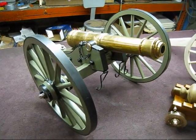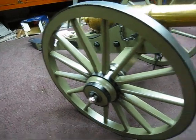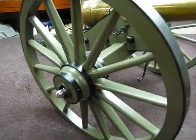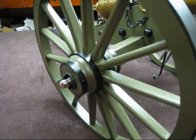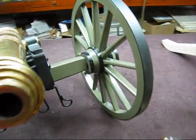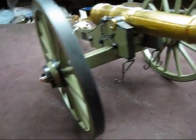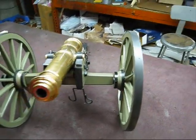One thing I forgot to mention on this completed cannon carriage was the paint job. There are three coats of Interlux 1026 wood sealer on everything and then one finished coat of Rustoleum in olive green. I actually had to do these spokes with the sealer using an artist brush — I built a little jig and set it up so I was able to spin it as I did it. In one day I put three coats of sealer on, then the next day I sanded it, which took some time to sand all the spokes. Everything was taken apart, and then the next day I sprayed it on the same jig — I was able to spin it and it only took about 10 minutes to spray.